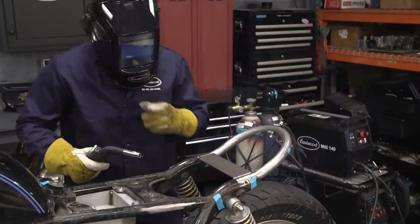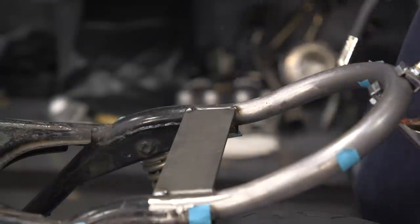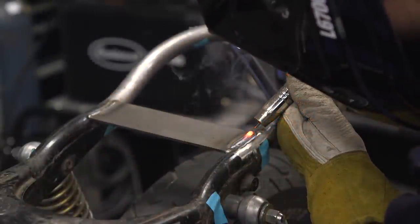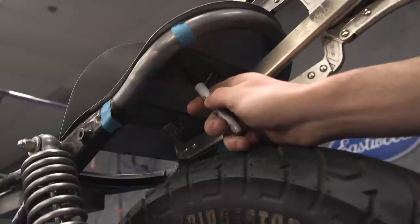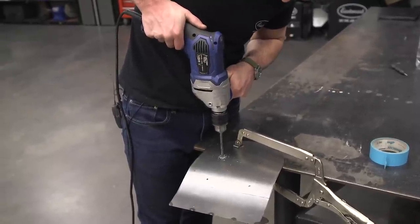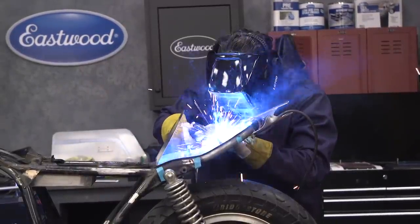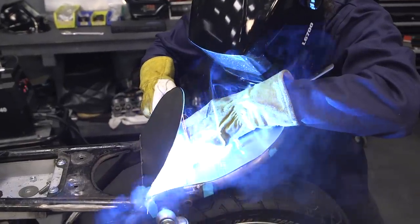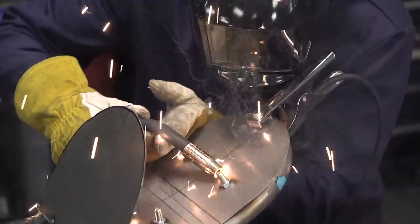What I did next is really nothing special — just some eighth-inch steel coupons cut to size perfectly so they fit flush with the top of the frame. Then I broke out the MIG welder and got them welded in on the flat spots of the frame so everything sits nice and evenly. Then I busted out the drill, drilled holes down the middle of those coupons for mounting up to the cowl, put the cowl on top, came up from the bottom with a Sharpie to mark where I needed to drill, then drilled that out on the cowl to match. I'm welding the nut rather than the bolt head — I don't want to mess up the look under the tail of the motorcycle. Just bolt everything down, tack on either side of the nut, and you're good. Hot tip: be careful not to weld the actual threads because you do need to back the bolt out.